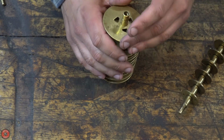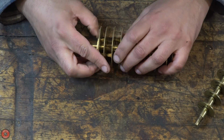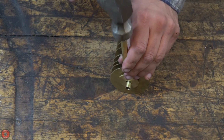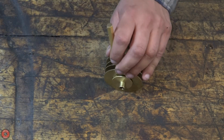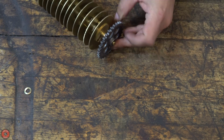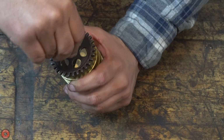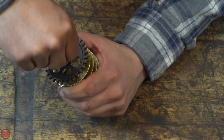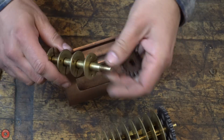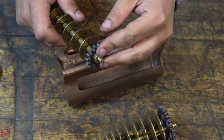Once you get them all together, you need to respace them and make sure they index back into themselves. They should be alternating between larger spaces and smaller spaces. And you'll see what I mean when I fully assemble it. It just helps it not run into the rollers on the top that are needed to cross over the cylindrical area of the discs in order to keep the paper or whatever you're gluing down to the gluing discs, if that makes sense. You'll see it perform very soon.